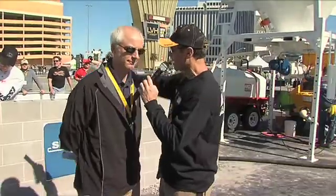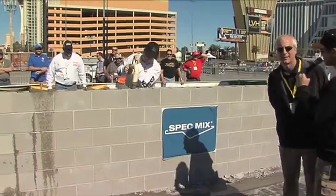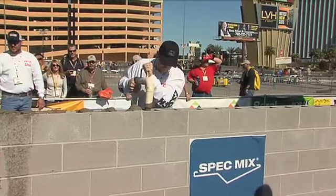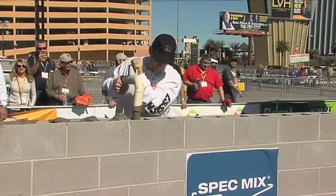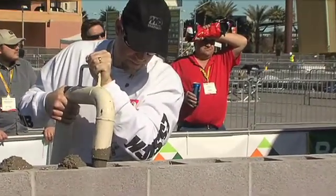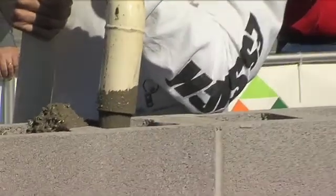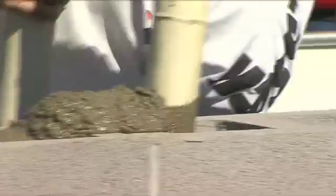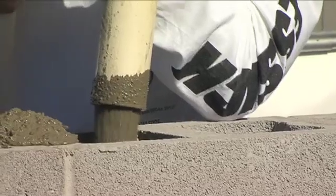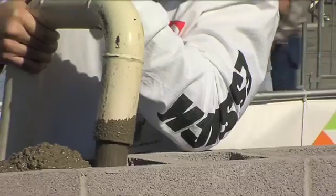Let's open up right here as he's filling the block — we can see this. The one thing we have to acknowledge is that concrete masonry is a versatile building material. It's got to be a weather barrier, provide energy resistance, be durable, but it's also a structural material. The grout is an integral component — you use it to interlock with the steel, providing tensile capacity, seismic resistance, and wind resistance. We're doing more and more grouting in the field these days, so anything we can do to make it more effective and efficient is the key.